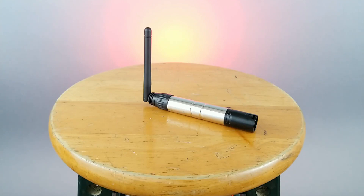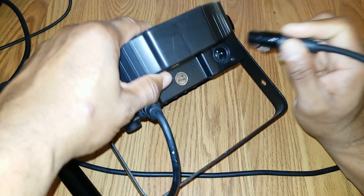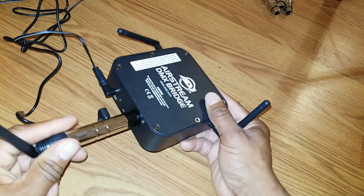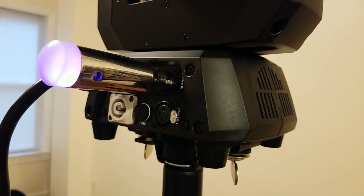The Donners are popular wireless DMX dongles that also allow you to transmit DMX wirelessly. The Airstream Bridge transmits the DMX signal wirelessly from the app to the ADJ interface box, but you still need a DMX cable to go from the box to the first light in your DMX chain. The Donners, however, allow you to not need a DMX cable, because the wireless transmitter attaches to the DMX out on the ADJ box and the receiver attaches to the first light in your DMX chain — or all the way across the room — without a DMX cable.